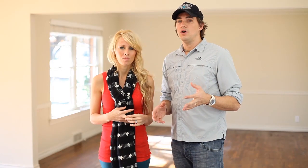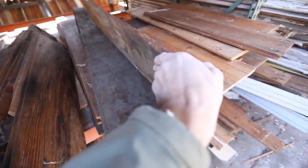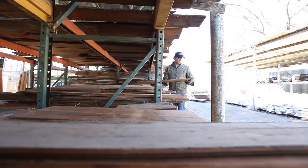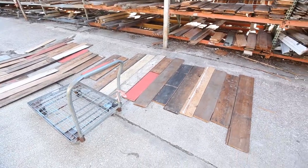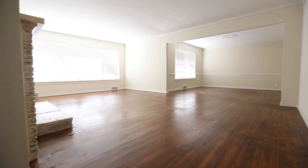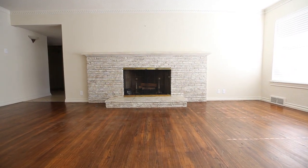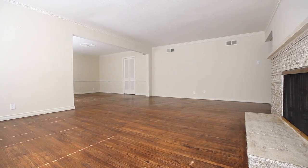Since I need an office at home, we decided to convert this dining room into my office. We're going to use repurposed wood from a salvage yard as our skin for the wall, and two-by-threes as an interior structure. Then we're going to build a door and hang a track so the door can slide open and closed. After we build the wall, I really want to decorate the space — make it feel really homey, with lots of textures and lots of colors. A place where we can have conversations, no distractions, no TV. A space just focused on our family.